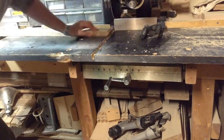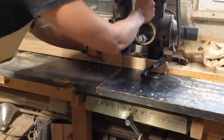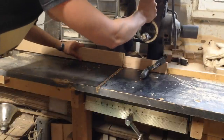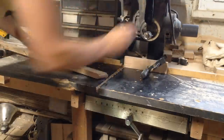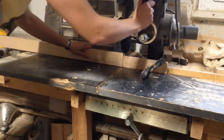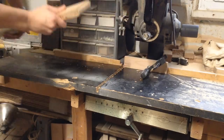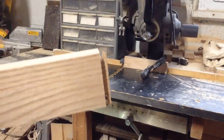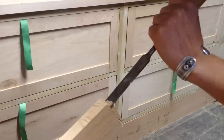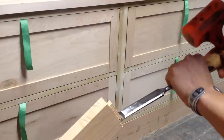With the construction of this piece, it was really important that all these pieces were square, which is why I spent so much time setting up all of these jigs. Then to remove those shoulders on the top and bottom, it's the exact same jig clamped to the fence, but I just raised the blade — I think I went about three-quarters of an inch down. This is so you're not removing a ton of material from the back side of that piece of wood; it just makes the mortise smaller. There's a little flange left over that I'm going to knock off.